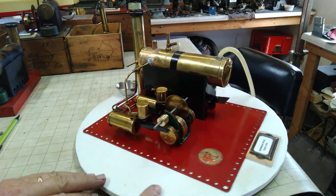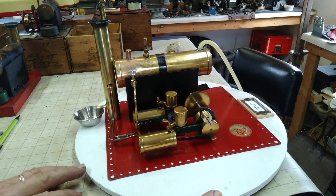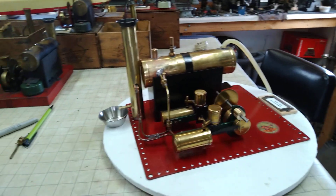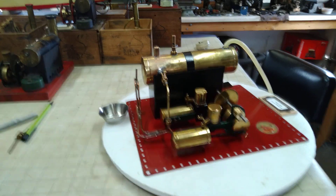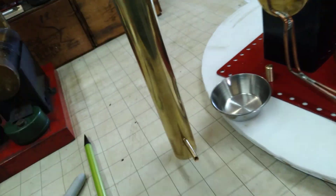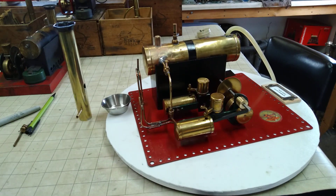I did a little work on the chimney. There really wasn't anything to hold it in place — there's no stay rod in this boiler to come out the back like some of them have. So what I did was make a brass lug right there, as you can see. There's a pin right there, and then I put a really thick brass lug on the bottom of this chimney. So it's kind of a locating pin now, and it works really well.